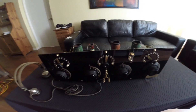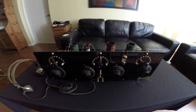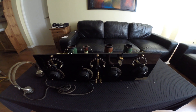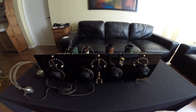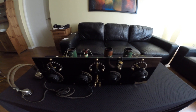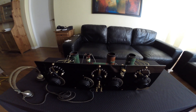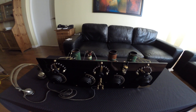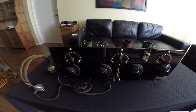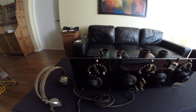The galena crystal is a diode that detects the radio signal. For any crystal radio, the same rules apply: you need a long antenna to collect the electricity from the air from radio signals, and the quality of the antenna, the ground, as well as your circuit design and your headphones will determine the loudness of the signal.